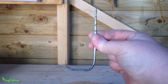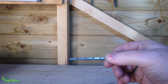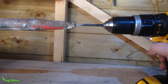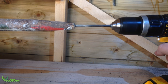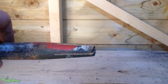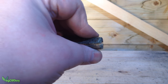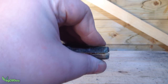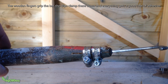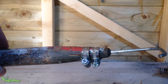For the tilting arm, I took some thin steel bar and bent it in my vise. I notched a few grooves with my angle grinder to help the adhesive grip it better. I drilled the hole in an old wooden broom handle, but it was a little too large. To reduce the slack, I cut opposing slots across the hole to make a crude wooden chuck. I mixed up a strong two-part epoxy adhesive and squeezed this throughout the hole and slots, then added a couple of jubilee clips to squeeze the wooden fingers together, gripping the bar in place. It held up a treat.